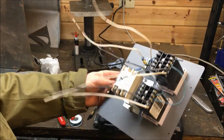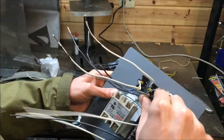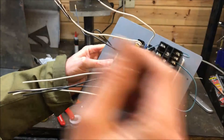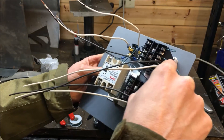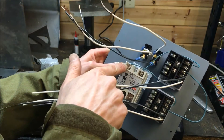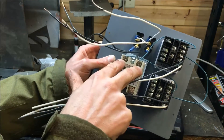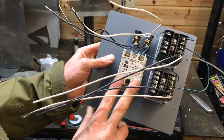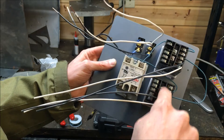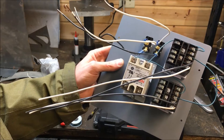So here is the box as it stands now. Got the temperature controller up here, AC positive and negative going into 9 and 10 — this is just what I described on the whiteboard earlier. The positive lead, positive 12 volts, goes through the timer to the relay and then back to the temperature controller. Once it gets a 12 volt signal, it closes the relay and turns on the heating elements. So if there's a temperature request and time, you get heat. The wires are also hooked up to the fan and the light switch.